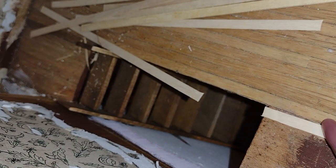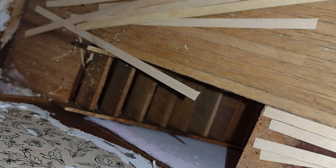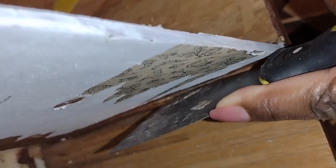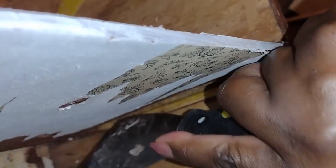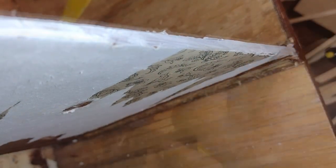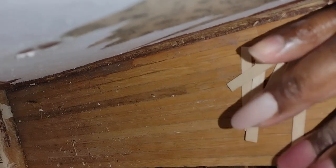I'm preparing to replace the floorboards on the second floor in the hallway. Just as I was about to begin, I realized there was a baseboard still attached to the wall that I hadn't removed. I used my blow dryer on the highest setting to soften the glue behind the baseboard to make removal easier, and it worked out really well. Now that the baseboard is out of the way, I've got my little pieces cut to replace the floorboards. After lining them up and gluing them down, I used binder clips to secure them while they dried.